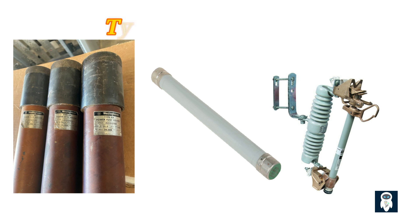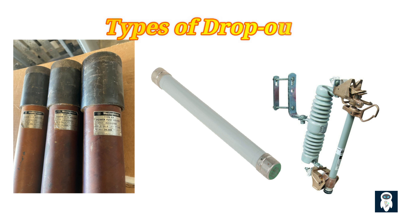There are several types of dropout fuses that are particularly popular, each with different construction and applications. BA type fuses are typically used in medium-voltage distribution systems and are designed for outdoor use, characterized by their compact size and ability to handle high-fault currents. DBA type fuses are specifically designed for use in underground distribution systems, built to withstand harsh underground conditions and provide reliable protection for electrical equipment. With their specialized construction and high-fault current capabilities, DBA type fuses are an essential component in ensuring the safety and reliability of underground electrical systems.